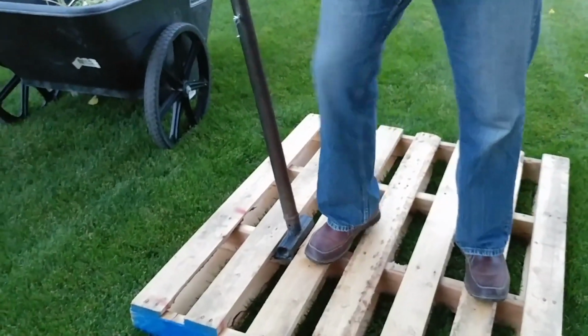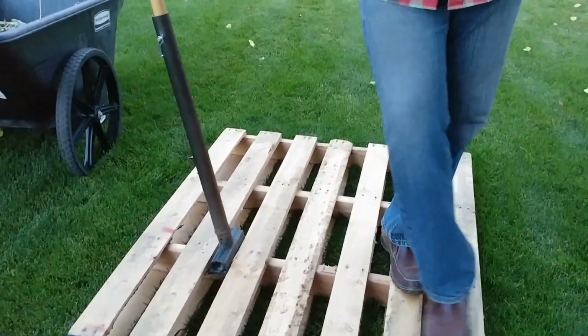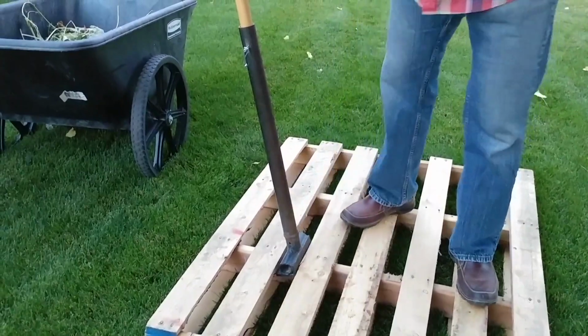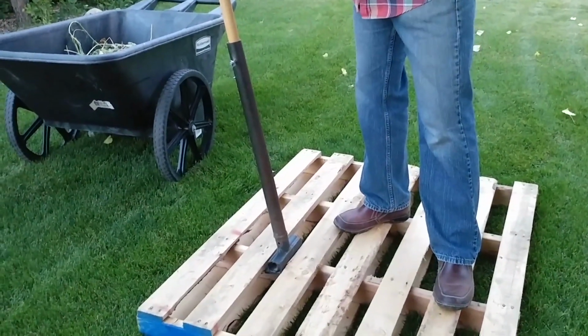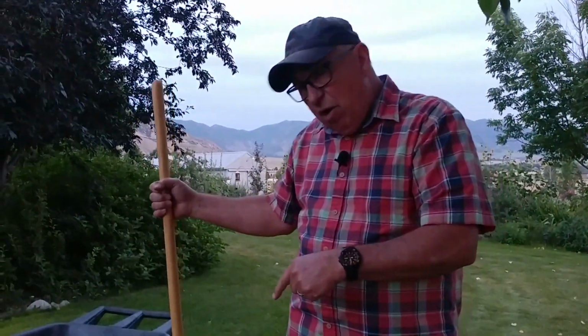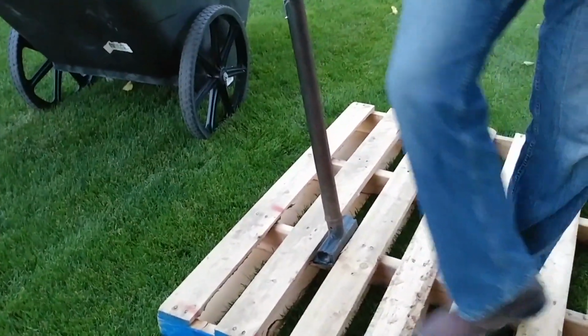And in this case, we're going to take out every other slat, because that's going to become a bin for a plant, that's going to become a bin, and so forth. So we're going to end up with four bays, or 4 rows, levels of 3 bays. So 12 different potting spaces ultimately when you see this later on. But right now we need to remove 3 slats on each one of these.